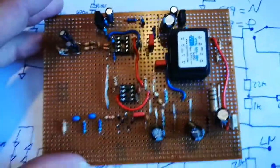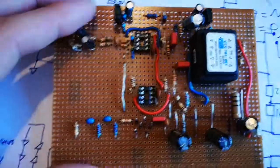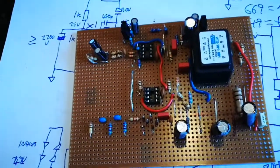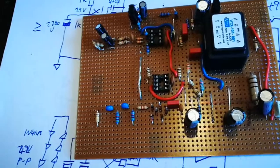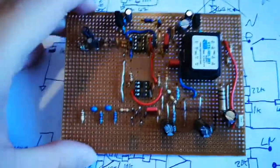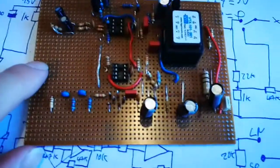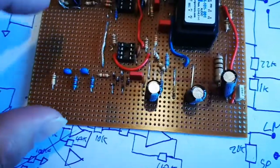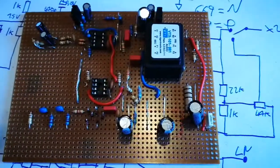The Chinese supply is currently limited to an amp, which is fine for testing. One option is to cut the lead on the Chinese power supply and shove some filtering in at the power supply end, but I feel like it's also kicking out RF all over the case. Next step is to start drilling the case out and thinking about getting it all in the box.